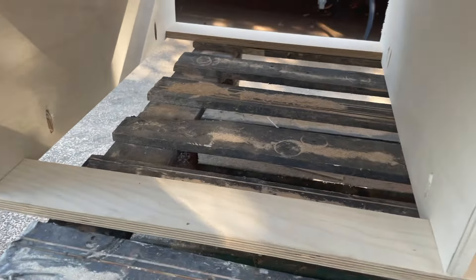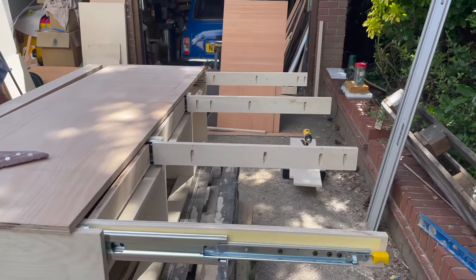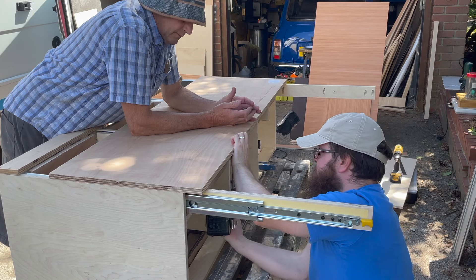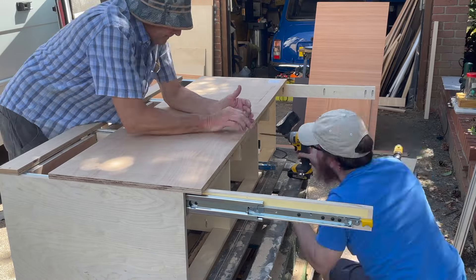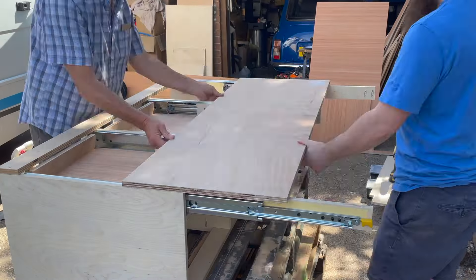This bit is the remainder of the bed base, but what I'm going to do now is cut the seating platform at 48 centimeters and cut the back piece in half so they're even — you'll see why in a minute. The drawer runners were then extended and we attached them using pocket hole screws, pulling the platform out a little bit at a time to ensure it would remain square with the rest of the unit.